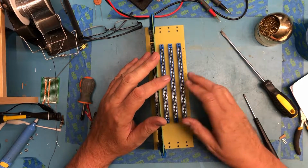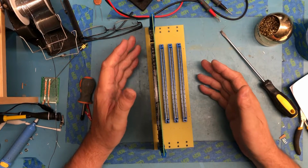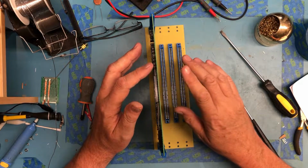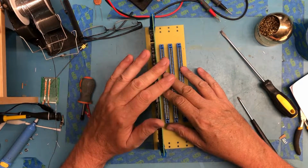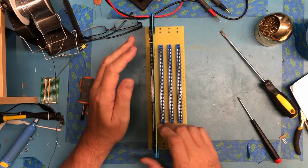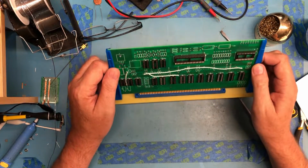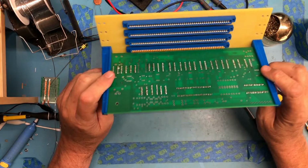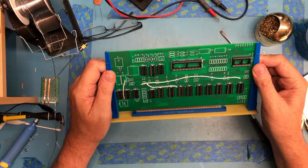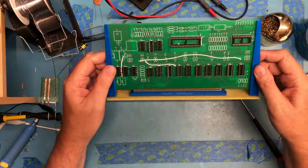It would be difficult to get a floppy controller in here. Using the older boards, it would be difficult to get a lot of RAM in here. I've got some 16K RAM cards. Again, they're full size like this. But 48K of those would occupy 3 slots. 4 slots just isn't really enough to get a machine. This is more than a very basic machine you can toggle software into and out of. 8 slots gets us closer, but mechanically I really like the way that looks.